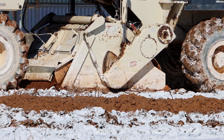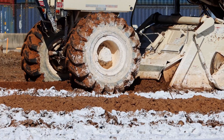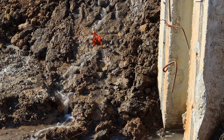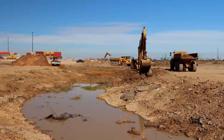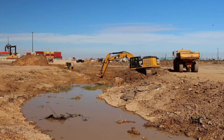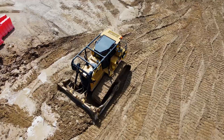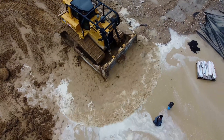As clay is treated, it is also graded to a slope, which is designed by the engineers to allow water to run toward the future drainage system. Next, we need to deal with the natural water table that is present in the soil. During rainfall, an extensive amount of water is added to the soil. Excess water would naturally try to find a way out of the soil into lower openings, such as ditches, creeks, and ocean. Our task is to control this movement and ensure that such water does not cause any erosion or swell inside the subgrade.